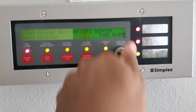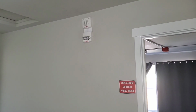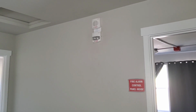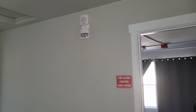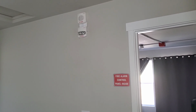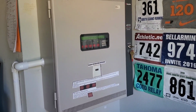I don't know. What's try continuous actually? Actually, no. That's too odd. Let's go ahead and do slow march time because I haven't done slow march on this panel yet. So I'm curious to see if it's 60 beat or 20 beat. So let's go ahead and change the coding option one more time and call it a day. All right, so now the system's set on slow march. So let's find out what cadence it is.